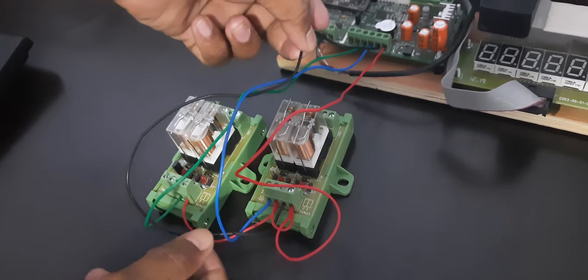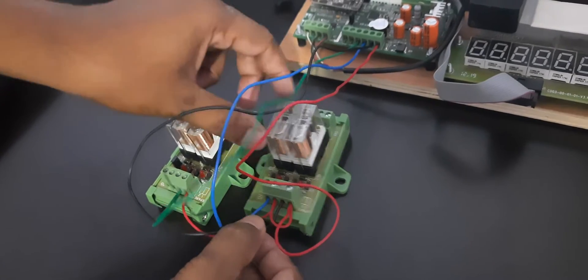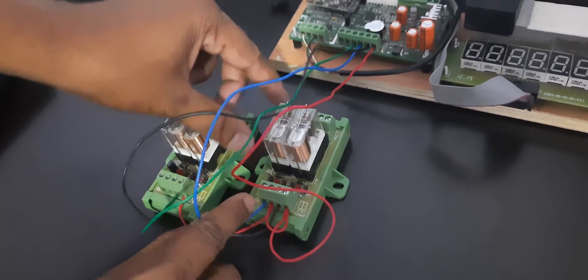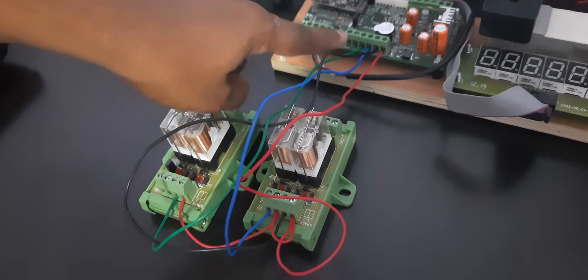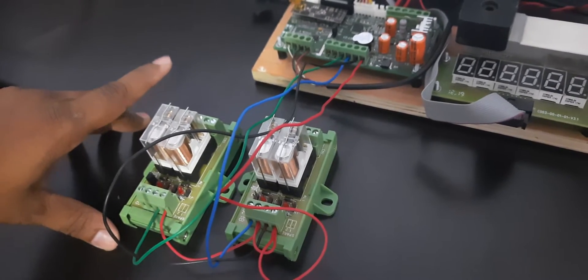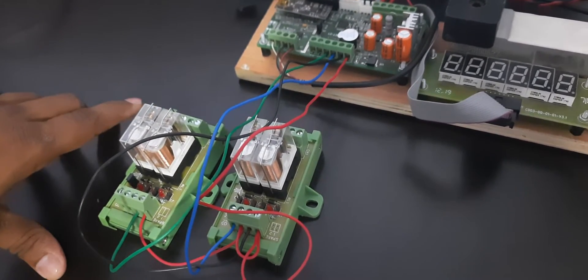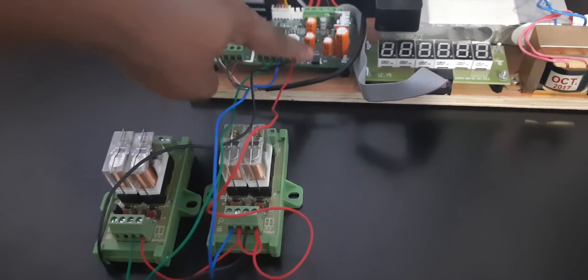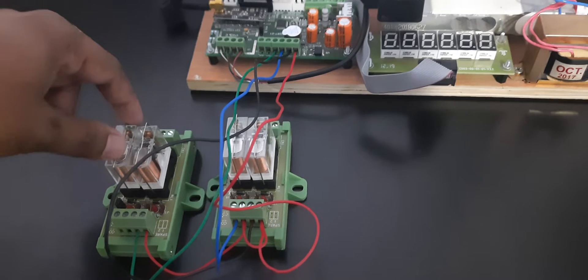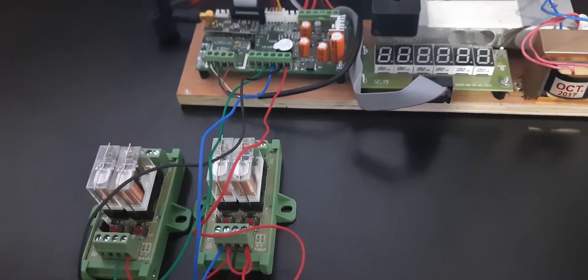The black wire is connected to relay 1 output, the blue wire goes to relay 2, and the green wire goes to relay 3. The SSRT supports 12V relay output only — it does not support 5V or 24V relays, so make sure you use 12V relays. You don't need an additional power supply because the SSRT can internally provide the 12V to turn on three relays.